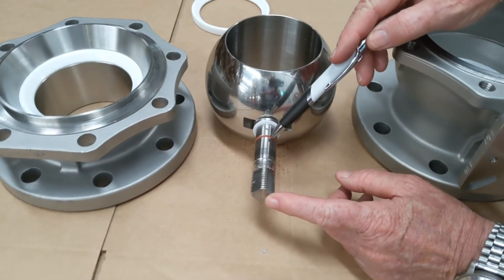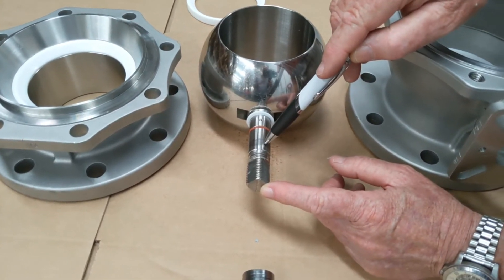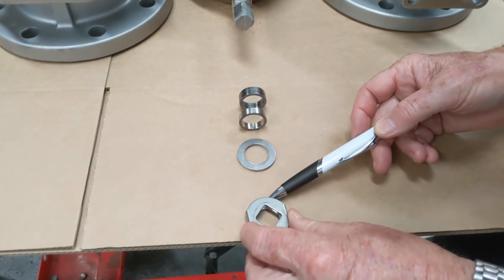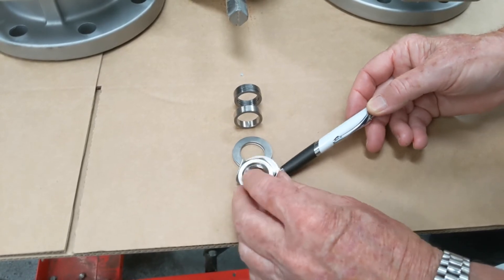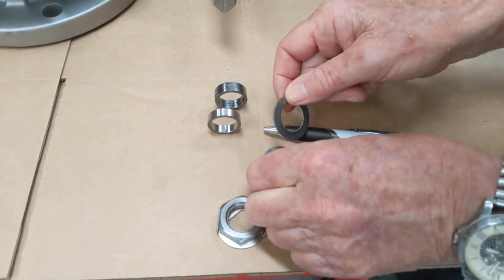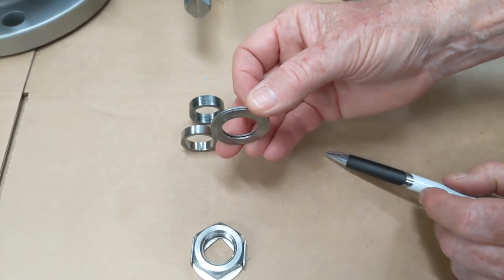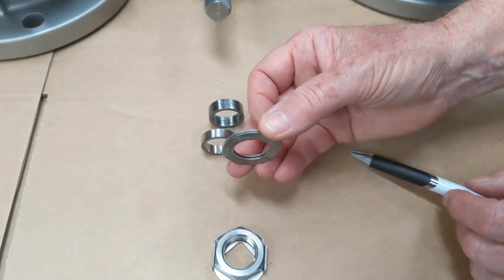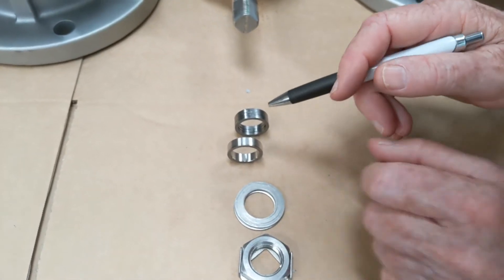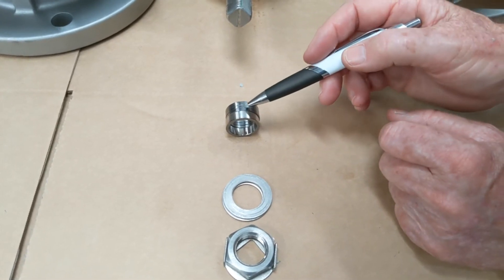The bite-on seal is a backup for a bubble-tight seal below the graphite chevron seals. These are held in place over this assembly. At the very top there is a nut with a locking face, then a set of Belleville washers — slightly coned washers which get compressed down and give a live loaded packing, so there is consistent thrust on the thrust washer. Unlike a gland which you screw down with variable thrust, this part slides up and down the shaft and gives constant thrust onto the Belleville washers.